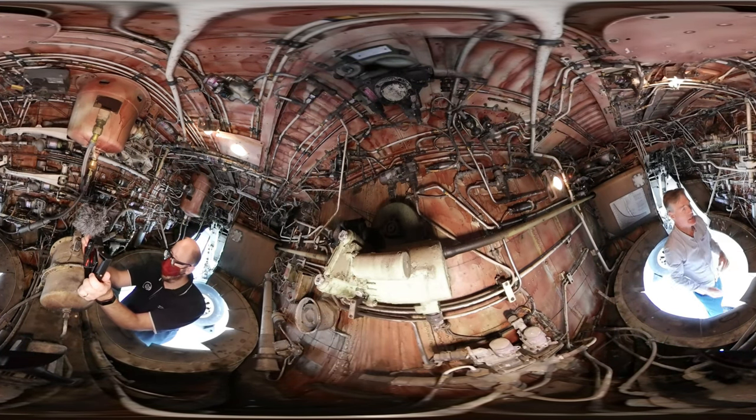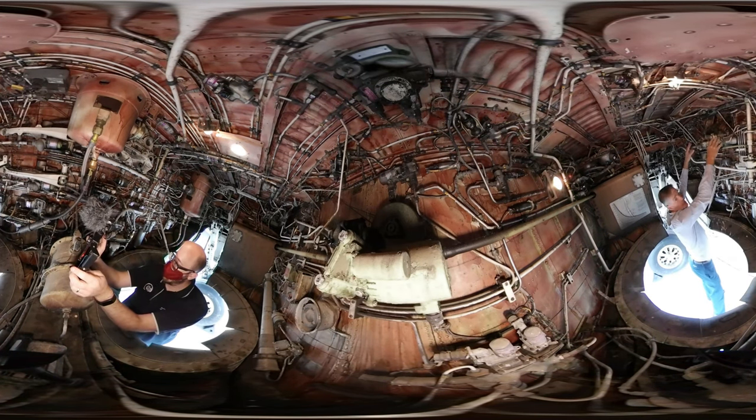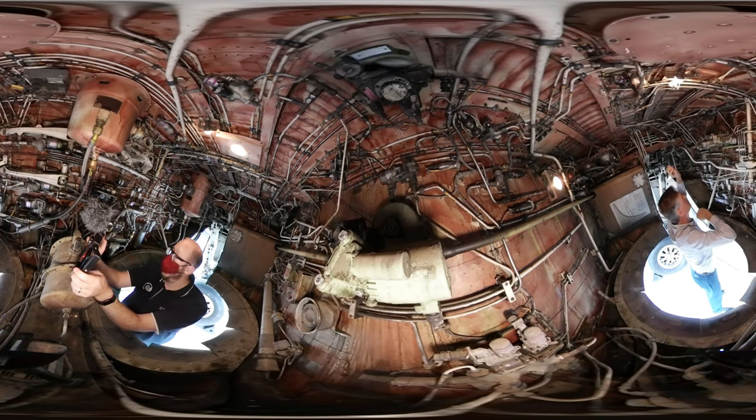So that's the basic control wheel input to the aileron. In addition to that, you know that the ailerons can be controlled from the autopilot, and the autopilot actuators are located here. You've got autopilot A and autopilot B — a couple of actuators — and they move these two linkages here, which are interconnected.